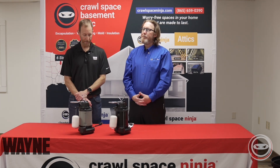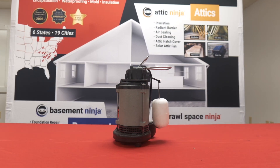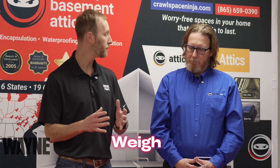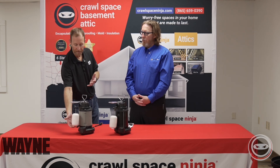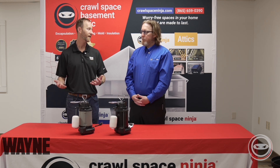Really what we're talking about here is the difference between the outer shell that goes around the motor and keeps the oil inside. With a plastic pump, it's going to be a plastic material. The cast iron ones are painted cast iron. Cast iron offers a couple of advantages — really it's the weight. When you have a heavier sump pump, it's less susceptible to movement, that sump pump shimmy when it's running. You want to avoid movement because you don't want the sump pump to get pinned up against the wall of the sump basin. When that happens, your float gets stuck and your float can't move, so the sump pump can't turn on and can't evacuate the water.